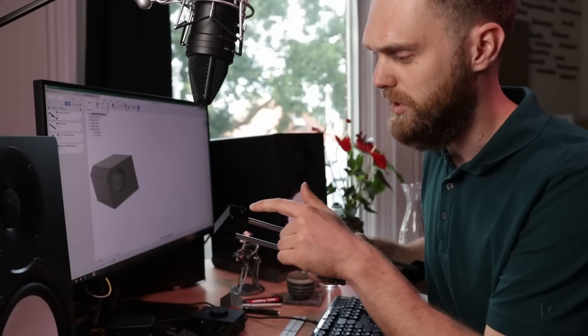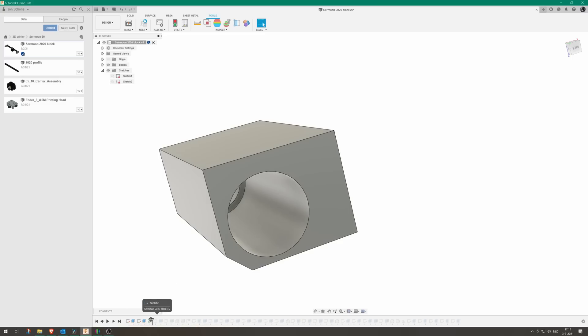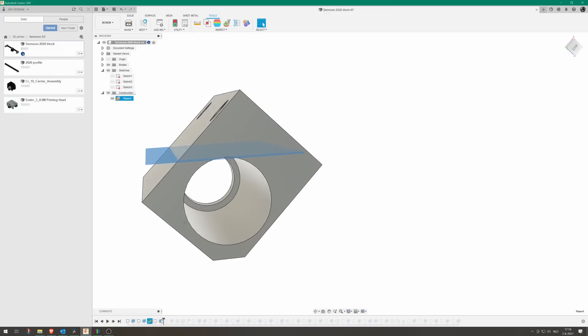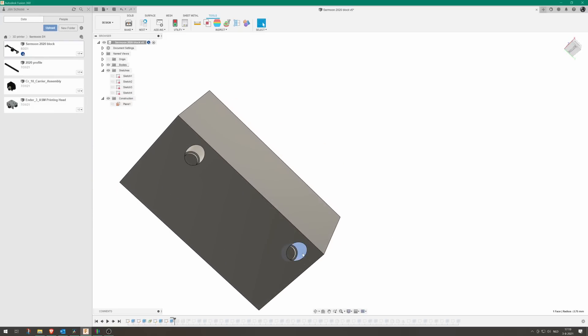There was one interesting part: the bearing, which is placed in here, is held in place with two set screws. Because I'm using inserts and the amount of material here is less than the length of that insert, I had to come up with a clever solution. So I used a reference plane at an angle of 45 degrees because I have more than enough material there. I added a sketch on there and placed those holes for those inserts, and I also added a ridge so I don't press the insert all the way through. One piece of advice: if you're going to reverse engineer, if you can download parts, just download them. I often use GrabCAD for downloading things like profiles or this hotend holder.